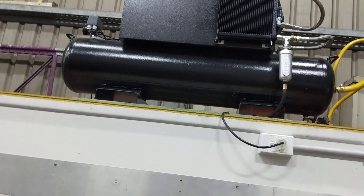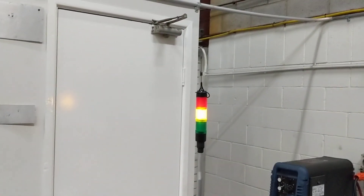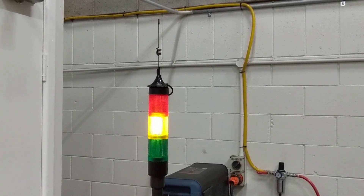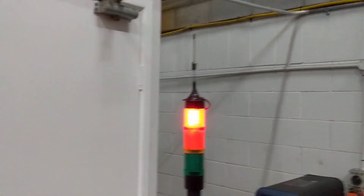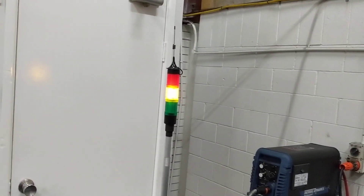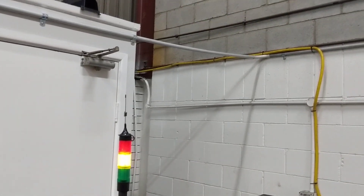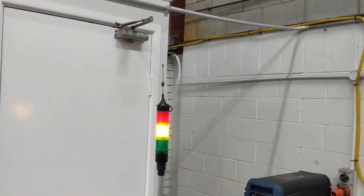This was something I already had at home before I came here where I had three phase power. Aside from our stack lights here — with a little antenna on top — the stack light has green, red, and orange lights. There's a video I did a long time ago showing how these work. If you hit e-stop you get a red light; orange says it's ready. When we're enabled, the orange light comes on, and if we run some g-code you'll see it go green.